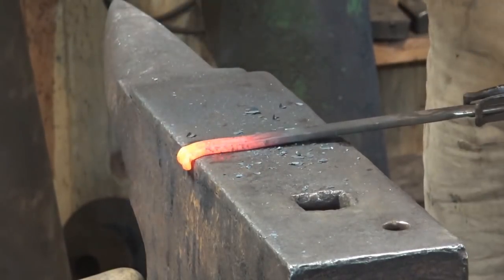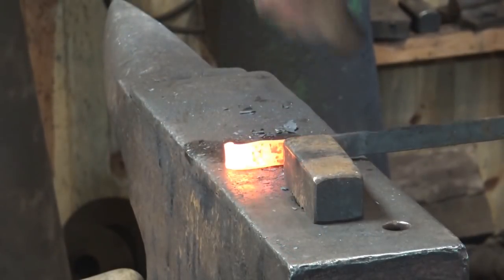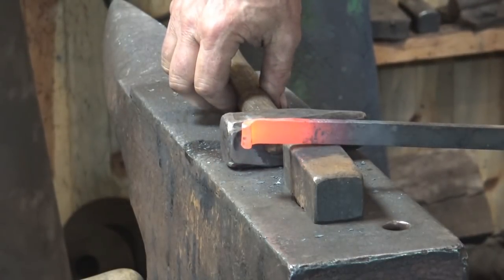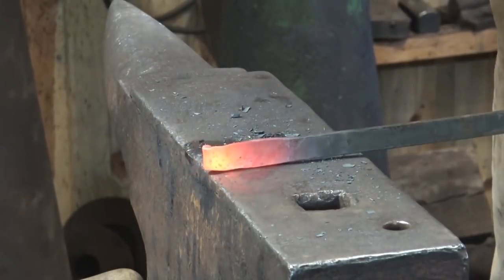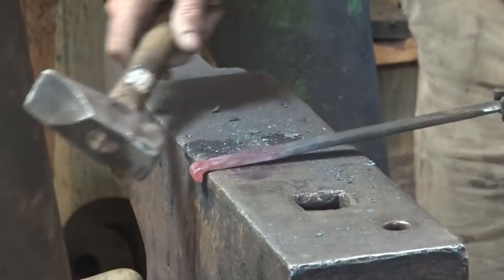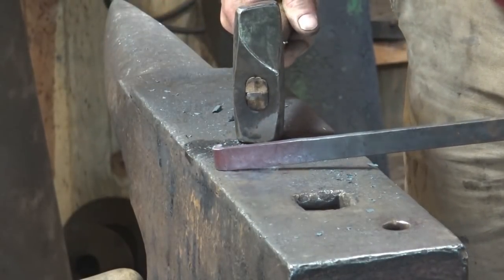Then I want to come back and taper this. My anvil does not have the crispest corners in the world, so I'm going to use an anvil block. In this dimension we want to keep it parallel, so we need to keep working that back to the original width. You can see how that's starting to get thinner and we're ending up with a bit of a snub in there. We'll refine that a little bit more after drawing more of this out. That snub is going to be kind of a round area. I may end up with a little cold shut there, but there's no stress on this, so it's not really going to hurt anything.